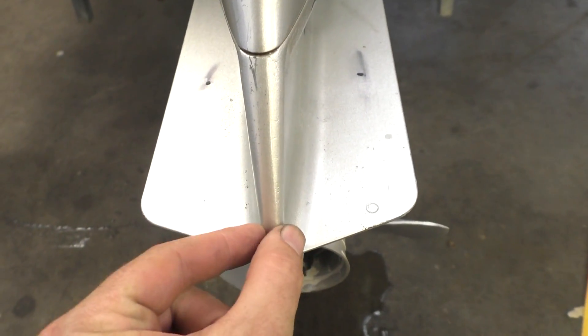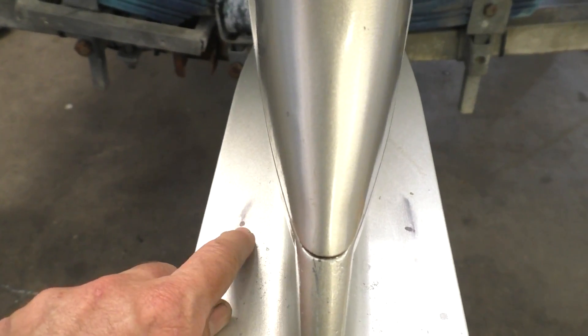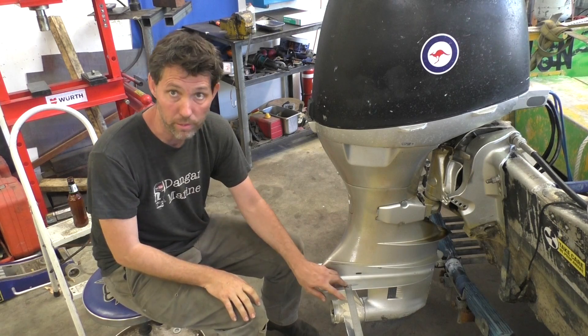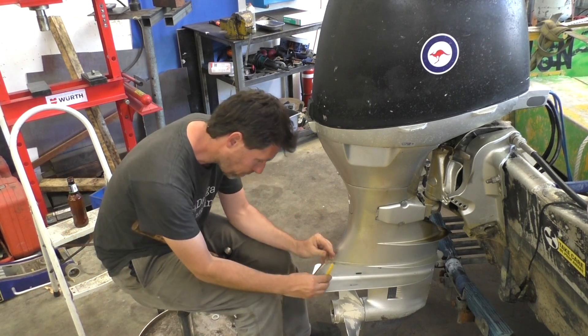Because the hydrofoil hooks in along here, it's centred there, I know. So I'll just quickly measure outside edge to these marks, just to make sure I've got it on square. These marks are 14mm from both sides, so I think it's pretty good to drill. I'll just mark all these with a punch so that the drill doesn't go wandering around.